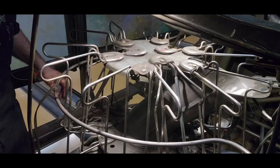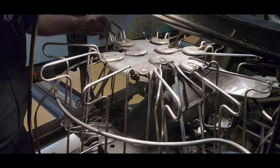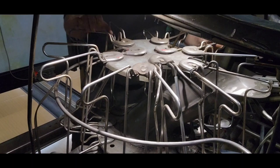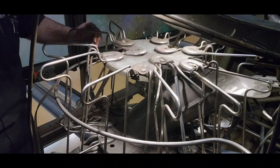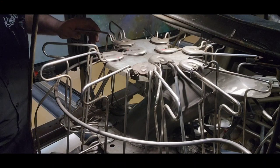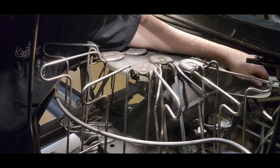We are going to be removing this turret basket and extracting some broken screws from the turret ring. This turret center chute and basket are kind of flippy floppy — there's only two screws holding this stuff together. The other four or five screws have broken off in the turret ring. They have some issues with the interlock probe; it really can't hold a solid adjustment if the turret center chute is flippy flopping around.